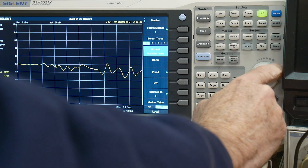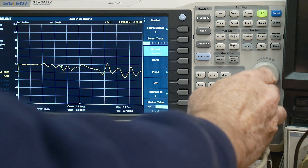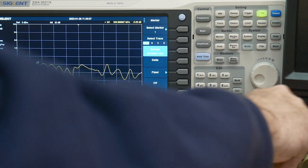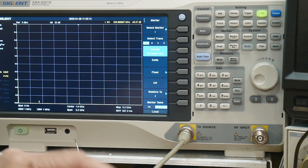If 1 dB was your error band, it's about 1.14 gigahertz where it finally falls away from 1 dB of insertion loss. People are always panicking over cables and connectors and adapters. I did a video once — I can link it below — on how adapters just don't add that much to measurement problems. And this by far is the worst — RCA to RCA to RCA. The quality of these: this one's not too bad, but this one's really bad.